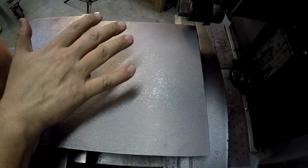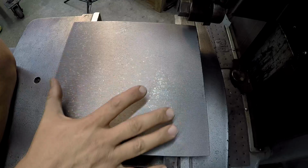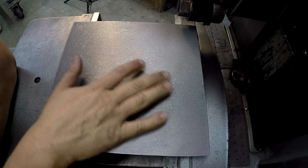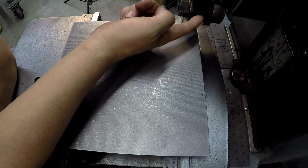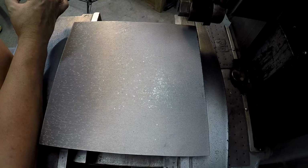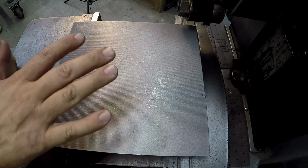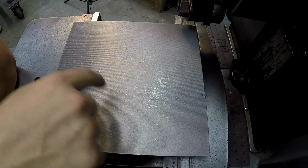And one of the benefits when you're talking about comparison is we just got this 10.5-inch square piece of material faced off in about 4 minutes. Okay, that's about what it takes. Now it's not finished, that's just a rough cut. We used one piece of high-speed steel that's mounted in this tool over there that you can regrind. So I didn't burn up carbide inserts. All right, and I have a nice pattern. I really like the patterns that these shapers make whenever they make their cut versus your swirl marks in there.